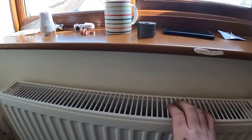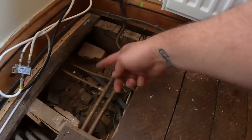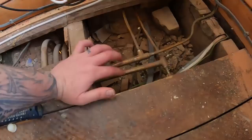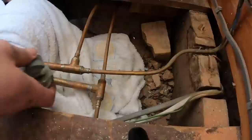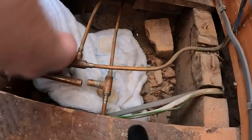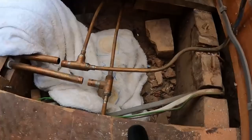We've got the new rad on now, the old one's off. Customer's painted behind the rad which makes it a lot easier. What I'm going to do is pipe up here, straight down, hook the pipework round. I've cut all the 8mm out - it's all here, best place for it. I've pushed two 15mm tails through into the next room so we can get onto them. Put two T-pieces on here, so we'll come off, elbow into here, elbow into this to pick that side up. Then come off there, pick this valve up, pop some copper underneath here and pick that valve up on that side.